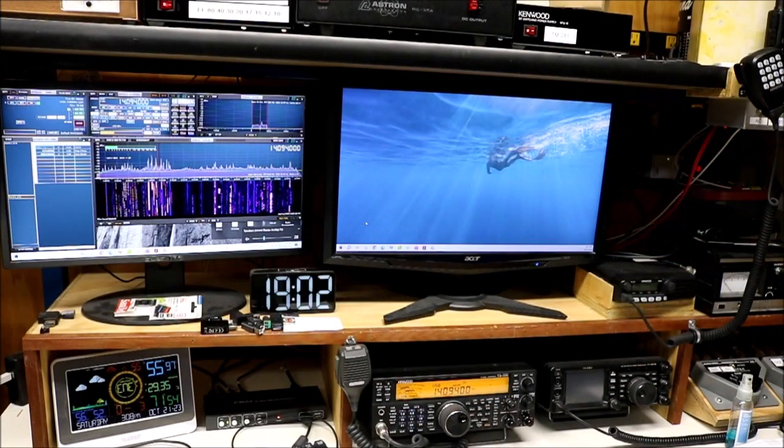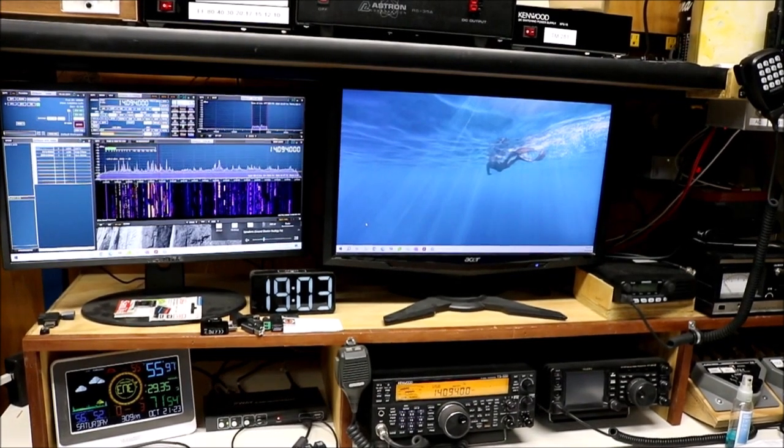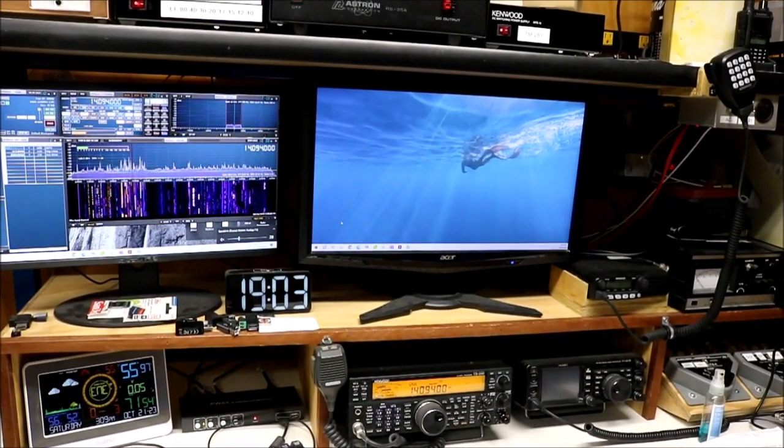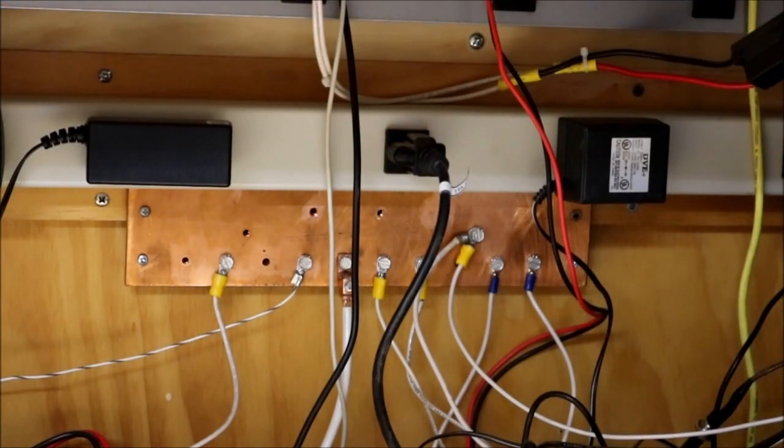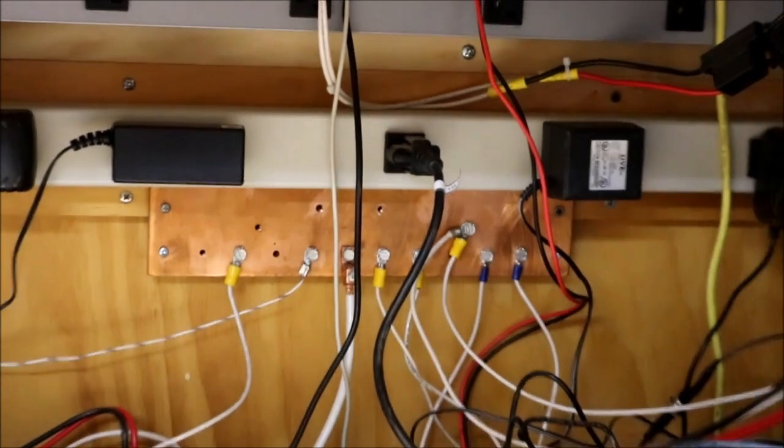If you remember last time, I showed how I put a ground system throughout the lab here in the ham shack by using 3/4 inch copper tubing. That travels all underneath the bench, below the bench, and goes around outside and around the yard. Well, what I did was, behind one of these displays, I installed an SPG called a single point ground. So let me take that display down and we can talk about that. Okay, I removed the front display on the right hand side, and you can see the single point ground there in the background. Let me zoom in a little bit.